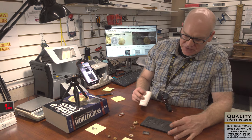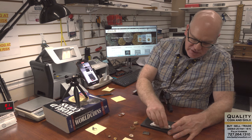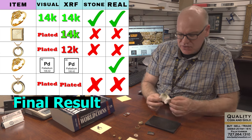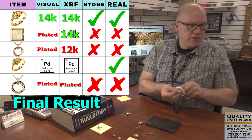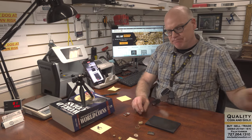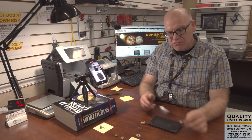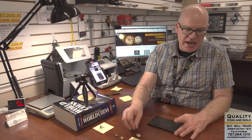That's why it kind of stinks in here — that acid is burning the base metals and that's the smell. The sulfur smell is purely from that. So I'm just going to clear this out with a towel. The stone test is the old, traditional way — the acid test, same thing. It's been done like this forever with different strengths of acid. It's 100% accurate, it's still needed.